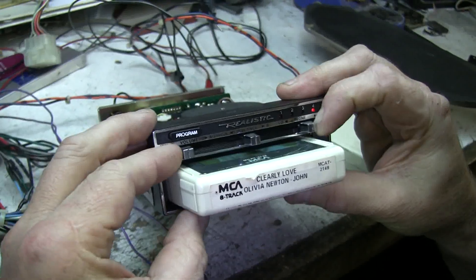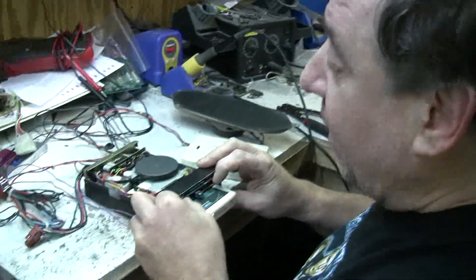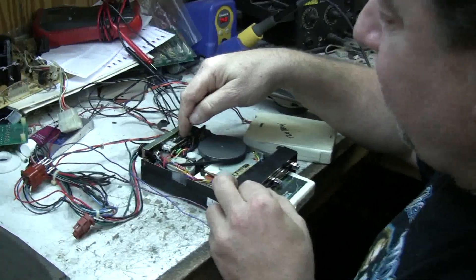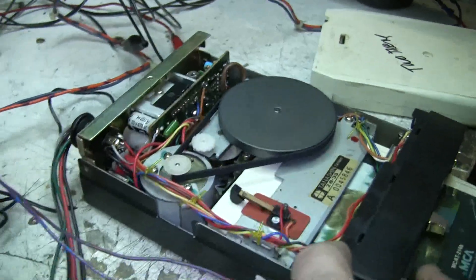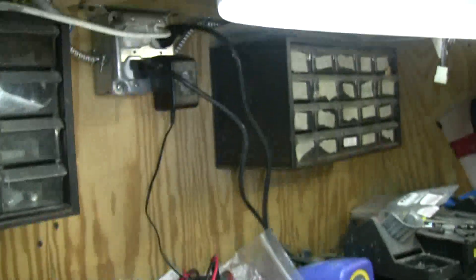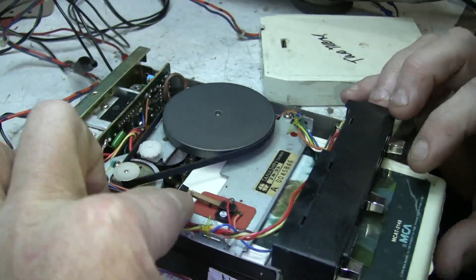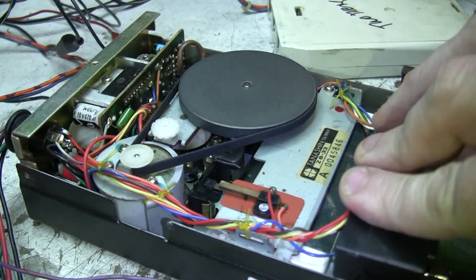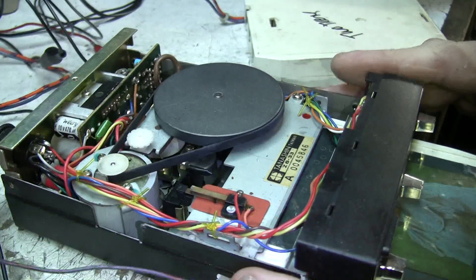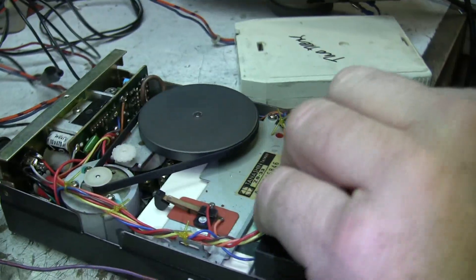It's the same old-fashioned stereo — left and right between the two speakers — and there wasn't much adjustment, but if you put bigger speakers you'd have something different. It's surprising how much they packed in here, because the circuit board — that's the amplifier right here on the top — it all ran off of 12 volts. We have a small converter up here. See this switch here? That actually turns the tape on and off, so when I slide the tape out it turns off the amplifier and the motor. When you slide it in there's a moment delay until the amplifier warms up — what they call instant on, no tubes.